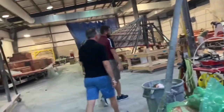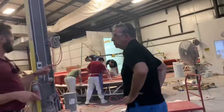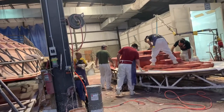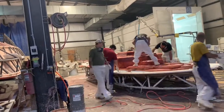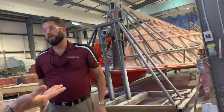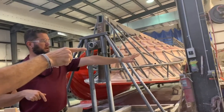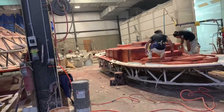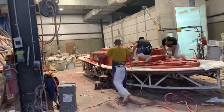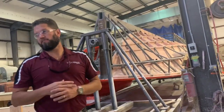Our 33s are all infused with the exception of a couple of small parts, but on the smaller boats we hand lay the deck. This is what hand layup looks like — you can see how potent it is over here, it really gets strong as you move closer. That boat is a deck — they pull it, flip it over, and that's the part you walk on. You can see how labor intensive this process is; there are six guys on that part alone. A lot of people really don't understand how archaic and labor intensive boat building is.